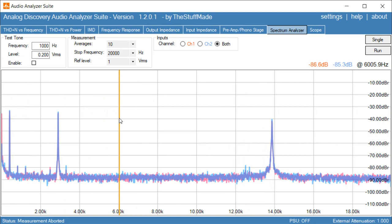So by using the bias control, we know if we add more bias, it's going to be lowering the level at high frequencies. We take some bias off, it's going to raise up the high frequencies. And if that's not enough to achieve a flat response, that's where Sony have the equalization feature, where we can then increase the level of these two until all three have approximately the same level. And then the tape is ready for recording.